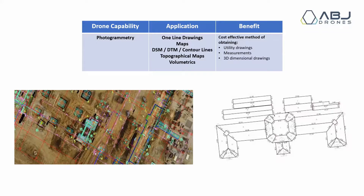The benefit that drones provide is that clients are not used to receiving a full high-quality visual map, which you are able to generate. The point of this is not just image stitching — it is to create fully scaled orthorectified maps which look exactly like Google satellite imagery, just much higher quality. You can also generate 3D models, and some of the industry terms you'll see include digital surface model (DSM), digital terrain model (DTM), contour lines, and topographical maps.